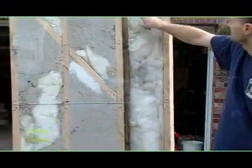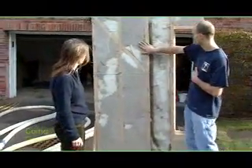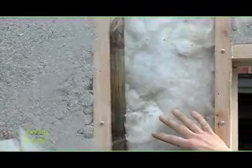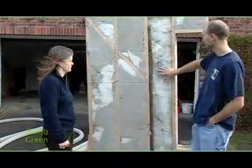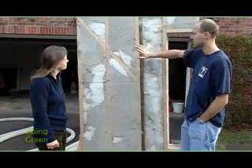So we have a few framing bays here. What is shown here is typically what you see with a fiberglass batt installation. You can see the fill tube that they use to fill these areas with cellulose. And this is the cellulose. What's important to see here is how much air space there is and how relatively little insulation there is. So if you had a house with all these air gaps, you could still benefit from having your house insulated with cellulose. Even if there's fiberglass in it, it may be beneficial, depending on how thin. In the home we're doing today they have very thin batt insulation, so we're going to address it by adding more cellulose.